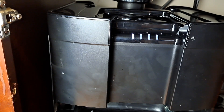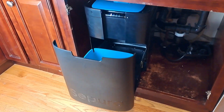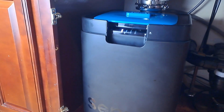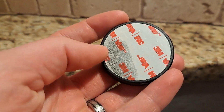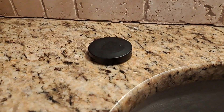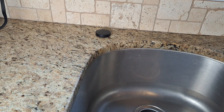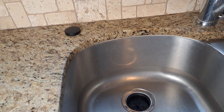With the lights flashing it's time to connect your Supura to Wi-Fi. Follow the instructions — really simple, like connecting anything else to your Wi-Fi. The Supura is now connected. We have the waste bin installed, the door closes, and up top we have the charcoal filter to make sure none of the smells come out. The light is on white. It was a little tricky to connect — I had to use an iPhone and it worked perfectly, but with my Android it did not work well. To install the button, clean off your work surface, peel off the 3M tape on the back, and stick it down where you want it. Press it once to calibrate the bin — this will make sure the height is correct based on how tall your sink is, so you get an accurate notification when the Supura is actually full.